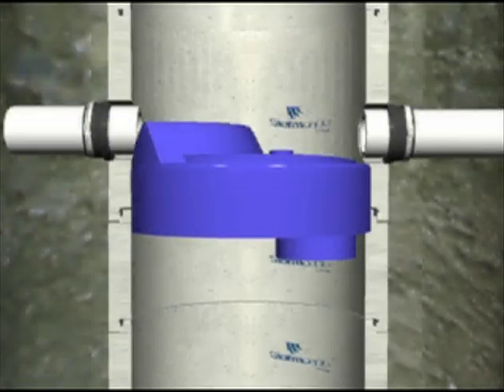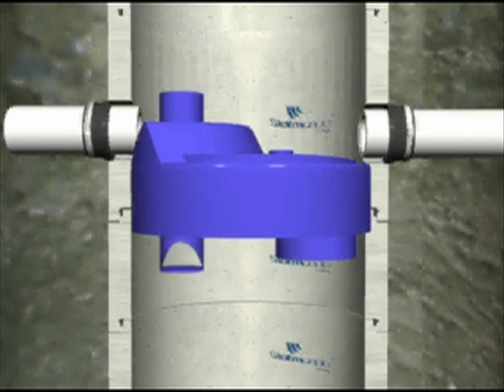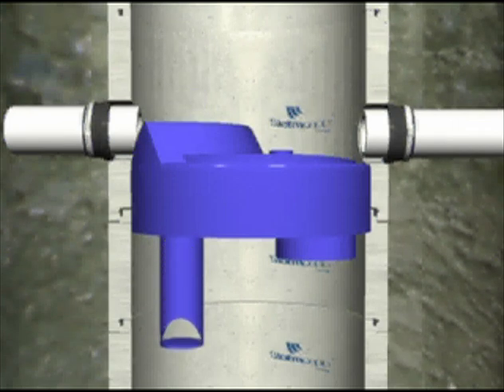For large units, the inlet downpipe has a T on one end. The T is installed by coating the outside of the pipe with Kimrex adhesive and pushing the T down through the inlet opening. The inlet pipe is elliptical, so the T will only fit one way, ensuring that it is properly oriented parallel to the wall of the storage tank. This alignment allows stormwater to flow in both directions along the sides of the tank and not directly into the wall.